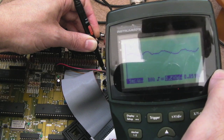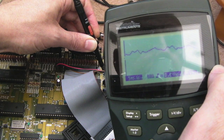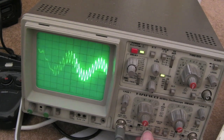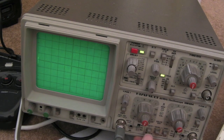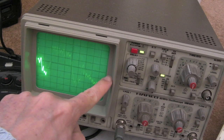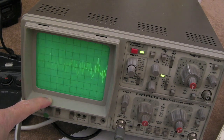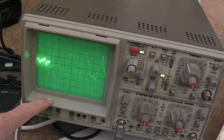It's very hard to see, but this scope is awful. So I'll go and connect the Hameg up and see whether I can do anything with the differential thing between channel one and channel two. Just setting the scope up again — I didn't realise there's a switch here to toggle between channel one and channel two, because yesterday I think I was showing either one or both of them together. What I was talking about yesterday in terms of ground, it being a positive or negative swing — yeah, that is the case. Although someone pointed out it's not in relation to ground, but I'd fail to see how it's not, because on the connector itself you've got ground and you've got the audio output — so it is in relation to ground.